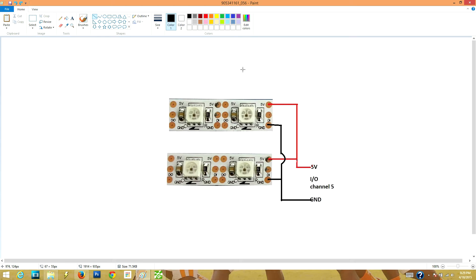Now as far as the signal that we're going to give them — the way this works with the Dragonfly 32 and CleanFlight is you have to have PPM enabled. What PPM does is free up all of your IO channels on the input side of your board, and you're only going to use the first channel for your receiver. That means you'll have all the rest of the channels free to use for other things such as GPS and of course LEDs.